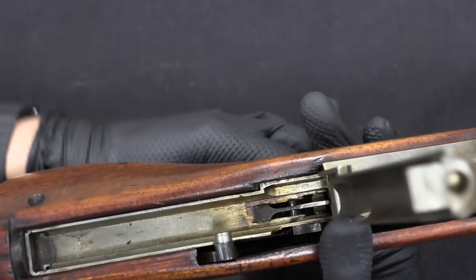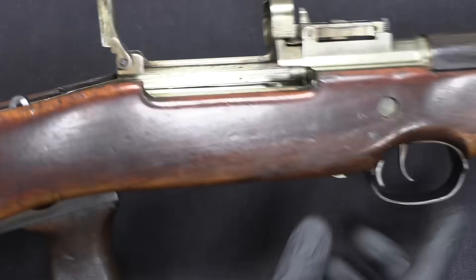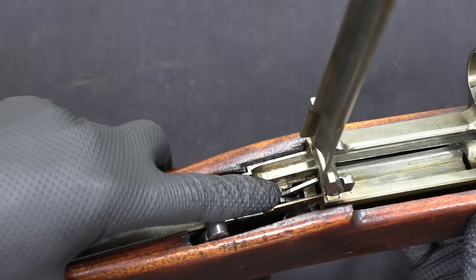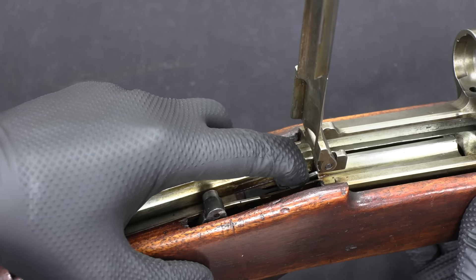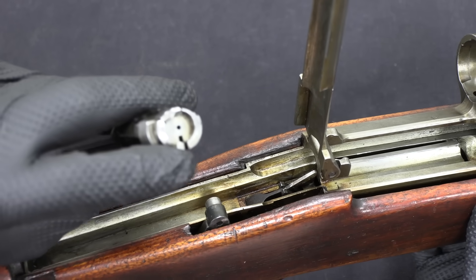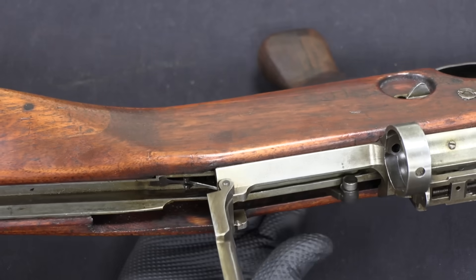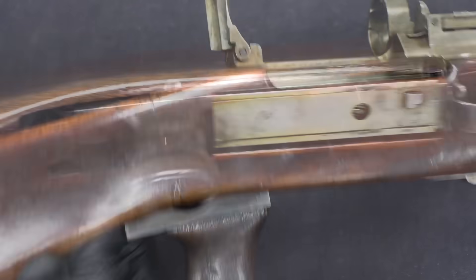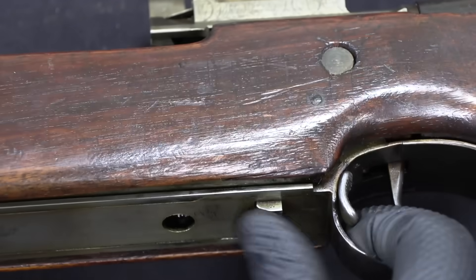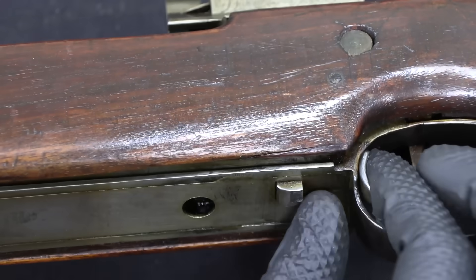There's really not a lot else to see down here. The trigger is fixed to the receiver while the charging handle moves. If I pull down on the trigger you can see it's going to pull the sear down, which will fire. This other piece is the ejector — that gets pushed down when the bolt goes forward. When the bolt's coming back it lifts up, comes through that cut in the bottom of the bolt, and kicks the empty case out. This peg is what holds the bolt and cycles it back and forth. On the bottom of the gun you can see the track that this runs in, and you can also see this locking stud. When the handle's all the way forward it's going to snap over that, and pulling this back just drops it.